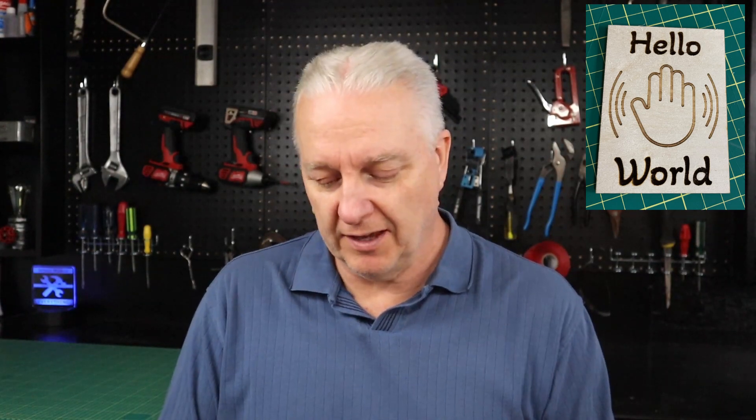There we go — we have another project in the bag. I'll post a picture of the finished product up here. As you can see, the text is much darker than the hand itself, as planned. I happen to have the original from the previous video — the original raster — and if I hold them both up, you can see: on the raster, as expected, it's all one shade. We could have made it darker, but aside from that we couldn't adjust things individually. With the vector-based one, we can individually select elements and change attributes simply by changing the color on screen and then adjusting a profile for that color. It really is that simple.